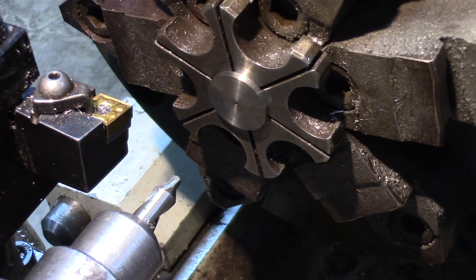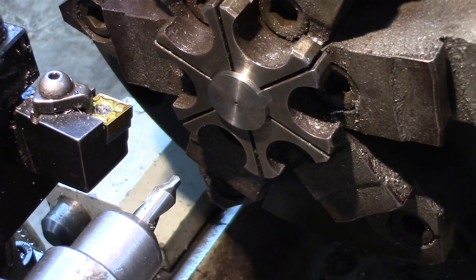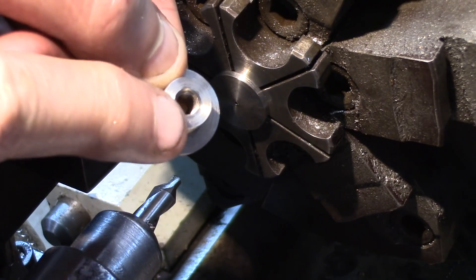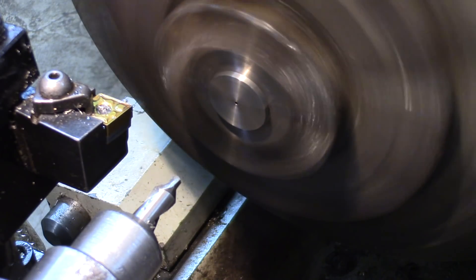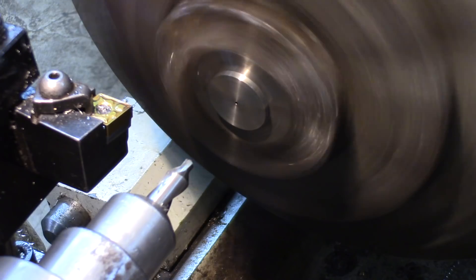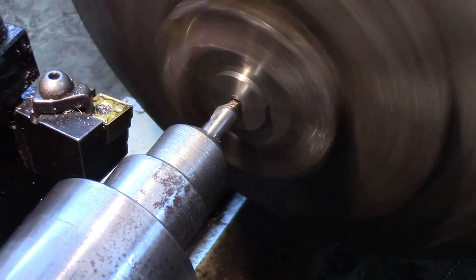I just finished surfacing that little knob here and I realized that I got a little pinhole in there. This is due to drilling the inside hole too deep. So I got a few solutions to fix this. The one I retained is I'm going to center drill this a little bit to make a clean entry for a drill after.